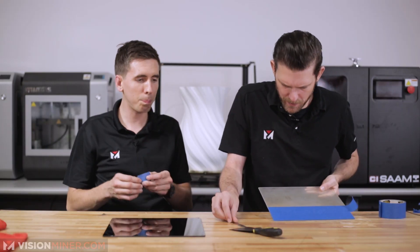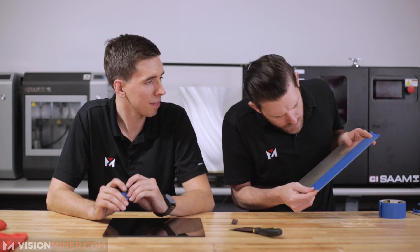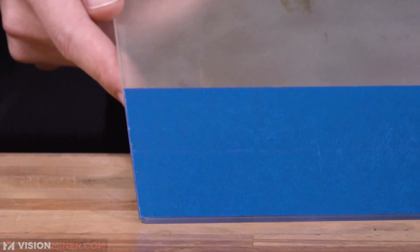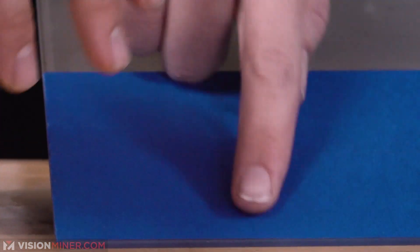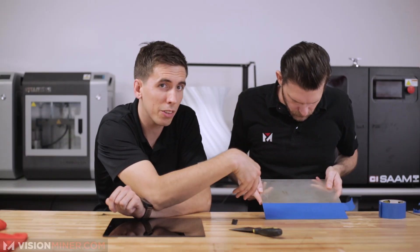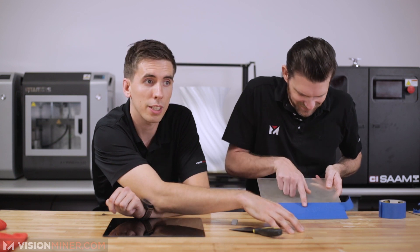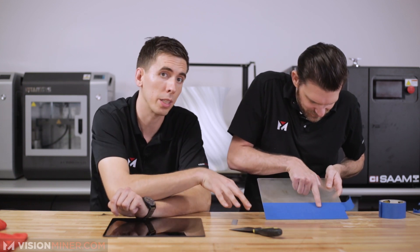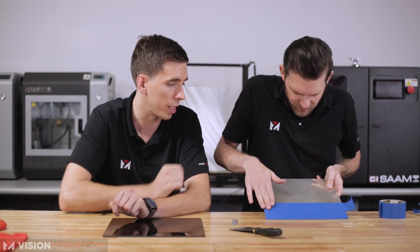If you felt it, you can feel that — that is perfectly acceptable. If you were to print on that, you would not see anything on the layer. You can get away with having a little gap; that still works. But overlaps generally tend to show as bumps in your print. So if you want a perfectly smooth bottom, do your best possible job at this.